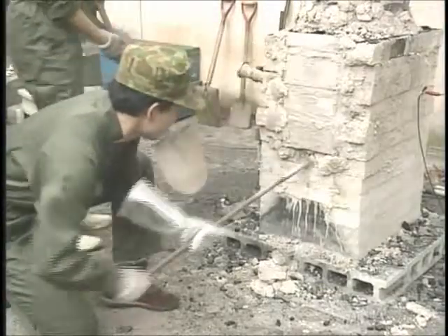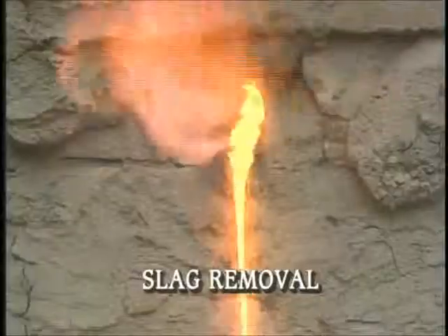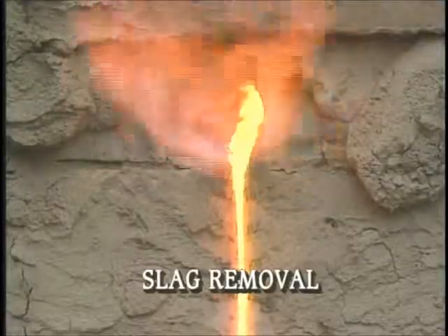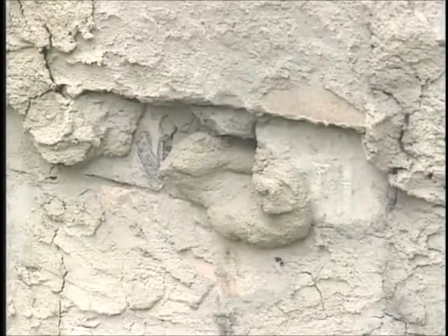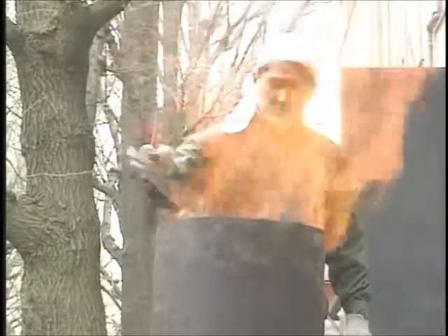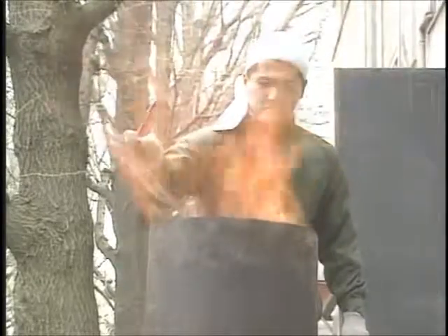When we've put in about 10 kilograms of iron sand we remove the slag. The impurities contained in the iron sand, which have melted as iron oxide, are removed. We monitor the state of the slag at the same place where lumps of steel will accumulate, and let the iron from the iron sand melt inside the furnace and collect at the bottom.